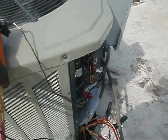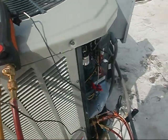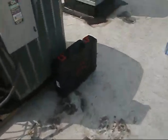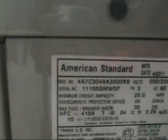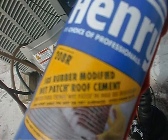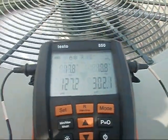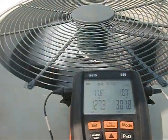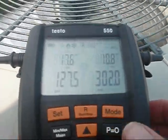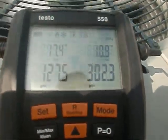Okay, y'all. We got her fired up. We're going to let her run good 15–20 minutes before we check her out. We're looking for a 10-degree sub-cool on this thing. I'm going to do a little sealing here. Dallas turned me on to this — this 208R is supposed to seal even in wet conditions. We were shooting for a 10-degree sub-cooling. We're at 10.6. We're allowed a variance of 3 with the TXV. We've got 17.6 on the superheat, 127.5 on our suction line, 302 on our liquid.